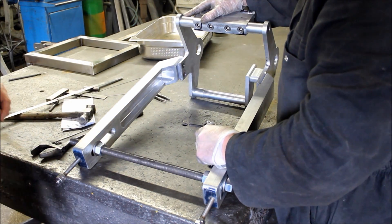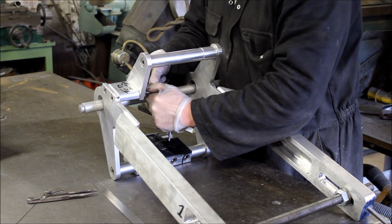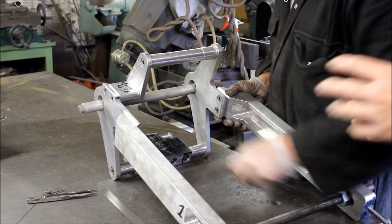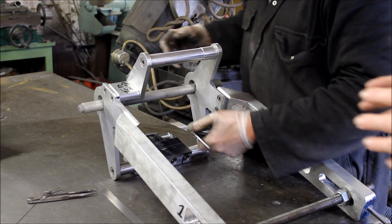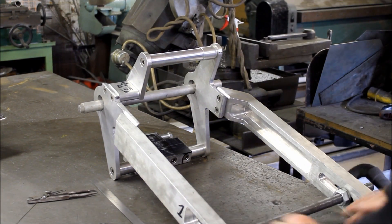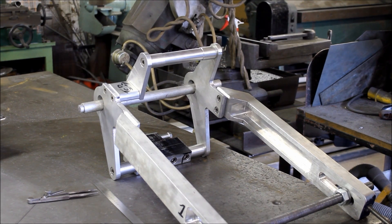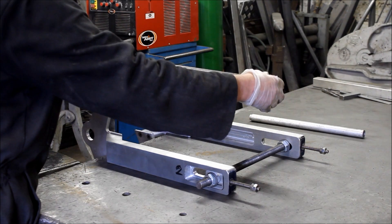The joys of making things! Let's turn it over. We put a straight edge between the pivot points where the bearings live at the front - that's the key point - and it looks like the edge is now level and parallel with the spindle, which is what we need. Everything else doesn't really matter too much, it's just really for show. We're going to tweak it a bit more and make sure everything's okay before we weld it, because once it's welded we can't go back - if it's wrong it'll be wrong forever. I can't see a difference now when I couldn't before, so panic over.